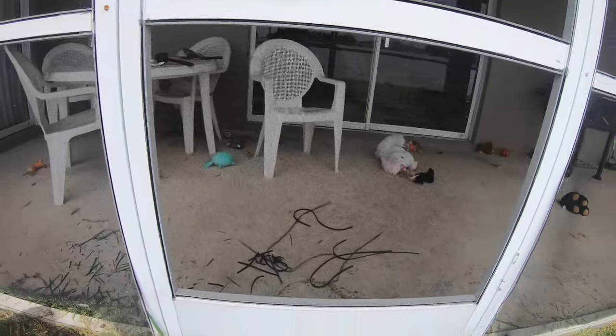There we go. One screen installed. Now I just have to do three panels and the top screen, but first I have to buy more screen. But as you see, it's not that hard. Just make sure it's taut. Use temporary spacers to hold the screen in place until you get it ready to go. Pop it in. I will say, depending on the spline tool you use, sometimes it does take a little getting used to get that thing figured out.